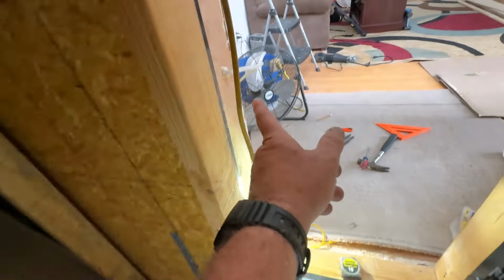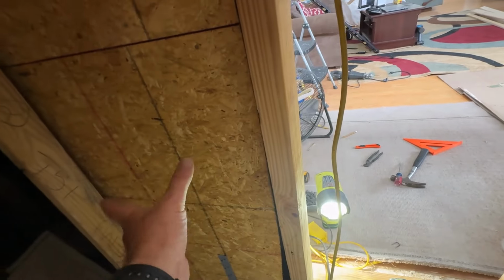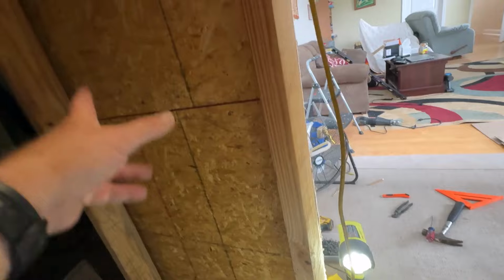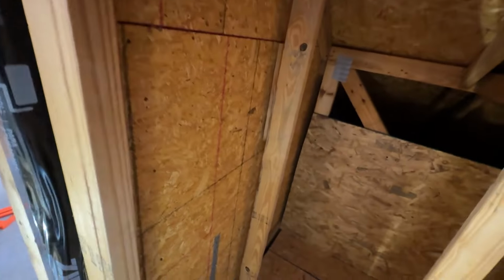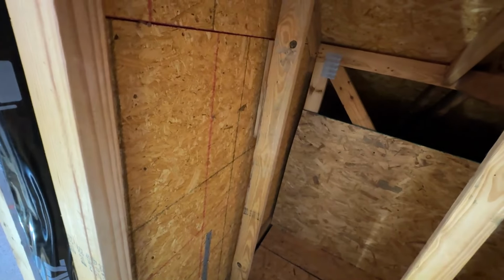All I got to do now is basically grab this electric, grab it on the back, make a new outlet box, rerun this out. I'm going to add an outlet there. Also over here, I'm going to do a pull chain light, and it's going to come around down this way to reconnect to that outlet, which feeds the rest of the upstairs room.